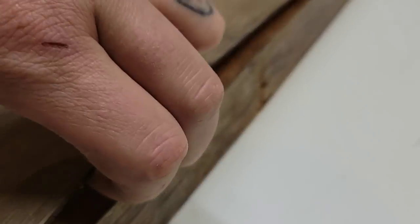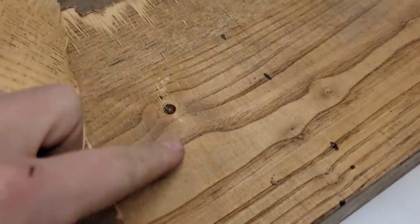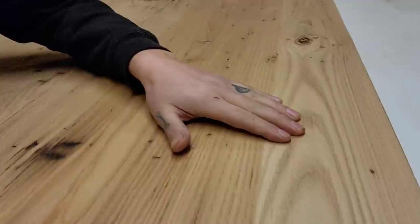Interesting. Very interesting. When I first started peeling away the veneer from this desktop here, I thought that the dirty wood underneath was either spruce or pine. And I was basing that off of the characteristics I was seeing in the grain. Wide open grain and lots of knots. Both very indicative of spruce and pine.